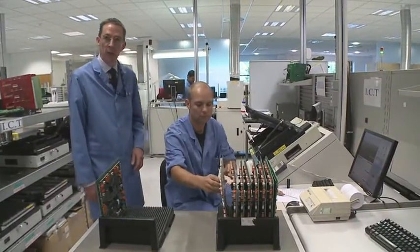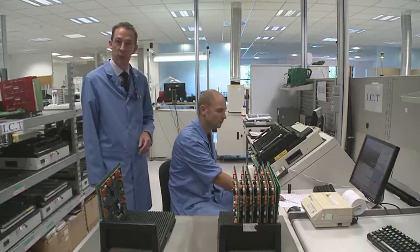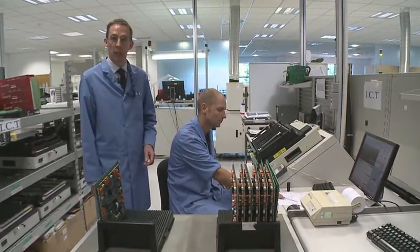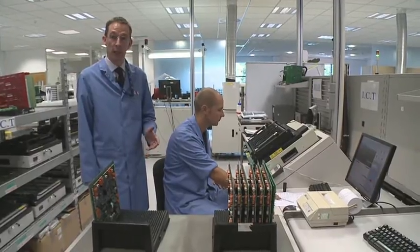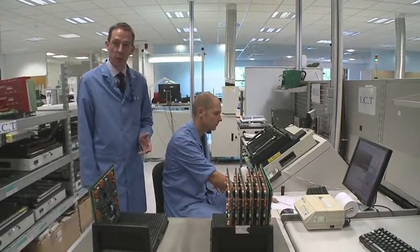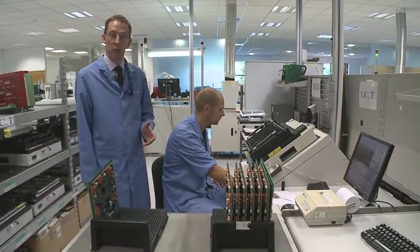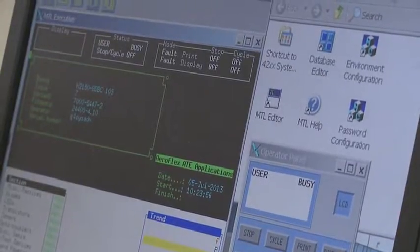What we see here is our in-circuit test capability for our M2150 Symmetry range. Chris here is testing a printed circuit board assembly. That printed circuit board assembly has now been completed and we 100% test everything we do. The reason we do that is to maintain our reliability in the marketplace. Our warranty returns are less than half of one percent, and we guarantee that by performing in-circuit testing of every product. Our first-time power-up yield is around about 99.6%, which is very important to us because we're also trying to maintain our customer requested date performance — issues with test yield could cause us to miss delivery dates.